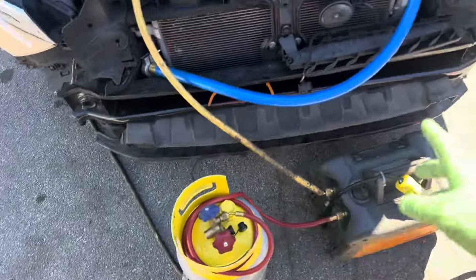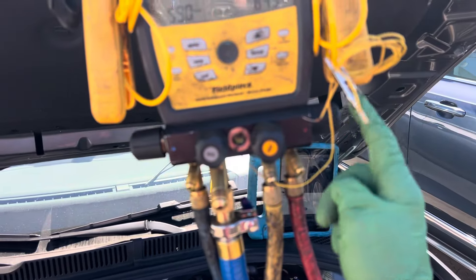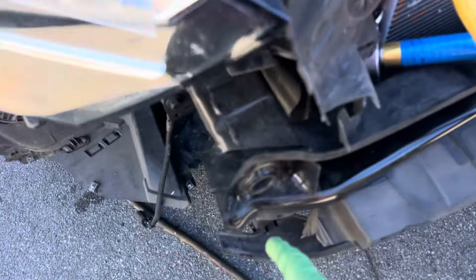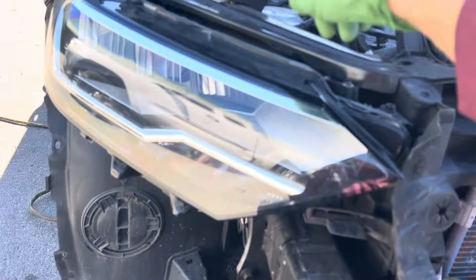We're going to perform a recovery on this. Hit the button, start the countdown. The high side is closed because I do not want to take up liquid refrigerant. This high side line is on the liquid refrigerant side — the liquid line connected to the sub-cool channel that comes out of the receiver. It's liquid all the way up to the expansion valve. If you recover from the liquid line, all the oil that has been rejected from the compressor and mixed with the refrigerant will be the first thing you pull out — you do not want to remove oil from the system. On this one, the suction line is located at the highest place in the line.